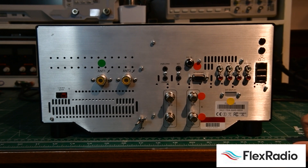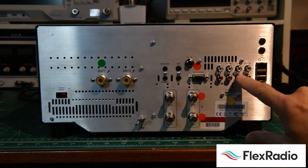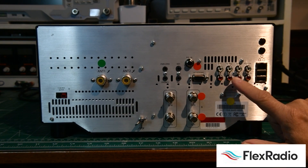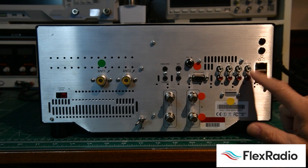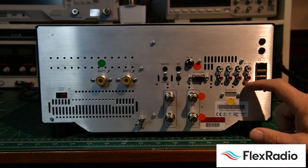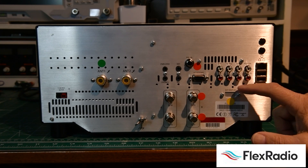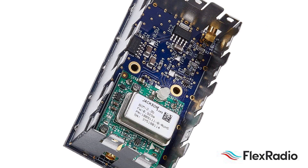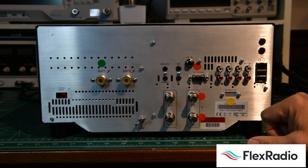Working our way across, we see TX1, TX2, TX3 — these are used to hook up any amplifier or amplifiers. You have three of these and they can be assigned by band. If you have a 10 MHz reference oscillator, you can hook it up and just send a 10 MHz signal — we don't care if it's a square wave or a sine wave. Or you can add the GPS internal option for a high stability oscillator, and then a 10 MHz reference output comes out here to feed other devices like test equipment.